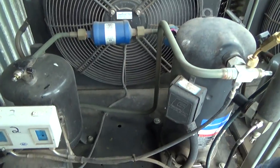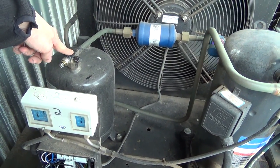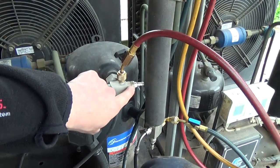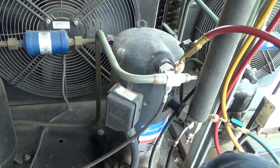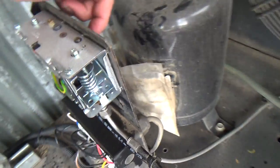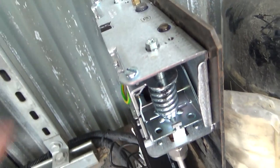So if you kept doing that it could contact it — so it's got to be that that's doing it. I've watched the high side pressure and it doesn't spike just before. If it's overcharged, they can pump down and go off on the high pressure switch because the condenser's full up before the LP cuts out. We'll pump that down — if we shut that valve, we can bleed the high side volume into the suction and we shouldn't have much pressure in there then. We should be able to change this switch if we've got one on the van. We've got our new pressure switch on there — we just need to check its operation and check for leaks. Something to be careful of when you put them on is how long these screws are — make sure they don't go through and foul on the workings inside because they can short out or stop it switching.